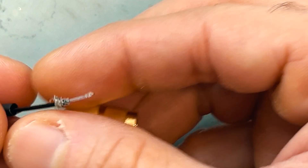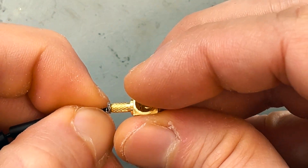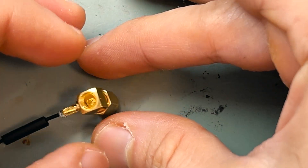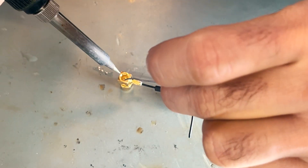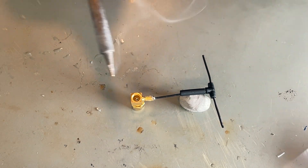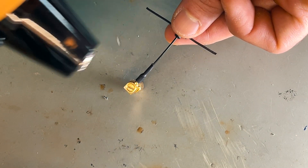At this point it was difficult to see what I was doing, so I used my microscope to make sure that when inserting the peeled antenna into the connector, everything was in the right place. You'll need to solder the inside so it stays in place and doesn't move around. The same applies to the outside — you solder the negative part to the outside of the connector — and I'm using shrink tube to cover everything and make it look nice and professional.